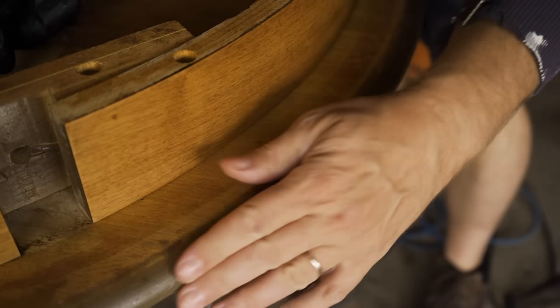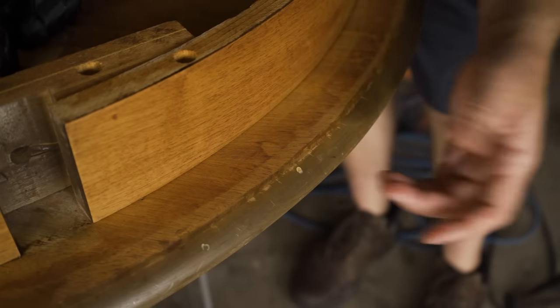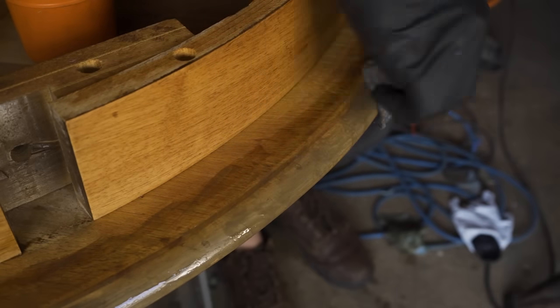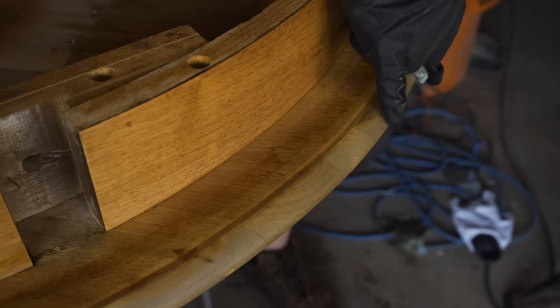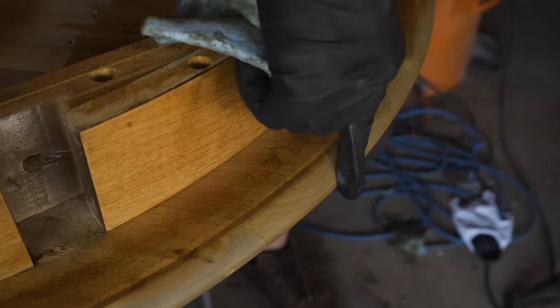The edges of the tabletop look like they've been painted, which would be to hide the end grain of the wood underneath the veneer on the top and bottom. I'm going to remove that too, and then I'll probably have to stain it really dark or maybe use paint again — I'm not sure yet. I got most of it off, but it's end grain so it probably soaked in pretty well and it's going to be tough to get out completely. Maybe I don't need to get it all out since I'm just going to be covering the end grain again anyway.